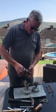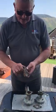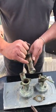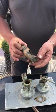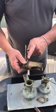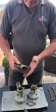Once you can get this out, this one explains what's happened with this ring. This ring wasn't in the right place, so when the guy thought it was shut, it was actually still partly open — and you can see the corrosion starting. That's quite common on valves where people don't know how to service them properly. Being an older valve, there are no O-rings at the top and bottom, so we know this is definitely a bronze arrangement.